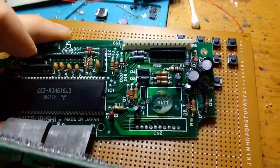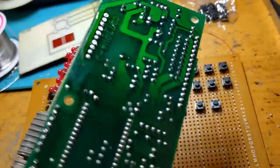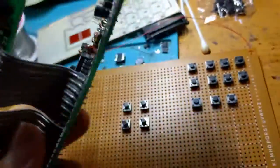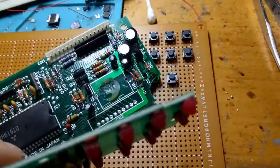So, yeah. If any of you have a sewing machine and a control box, change that battery, folks. Do it carefully. And look out for leaking battery acid and crappy old 80s flat flex ribbon connectors.